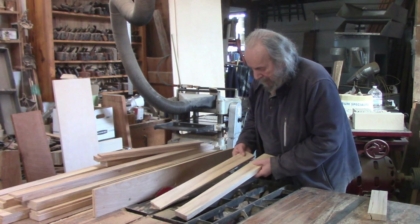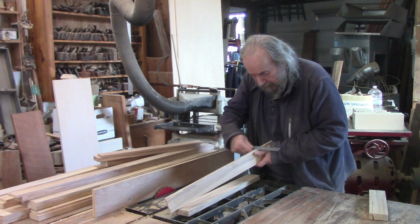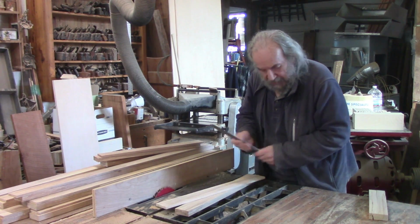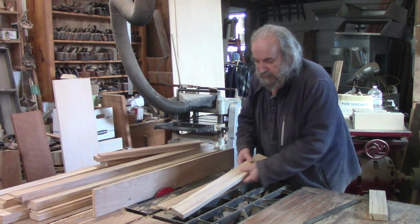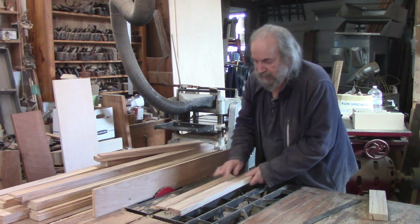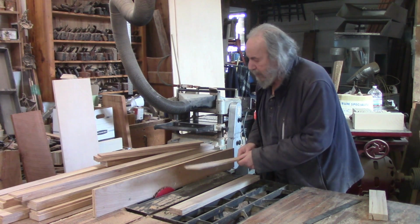Hey, so I just ran those all through the saw, and I've got these things that are ripped out to about 5/16, which means I can plane them easily without any fooling around, down to 1/4, actually close to 3/8 in places, but we're not counting that. Anyway, that's all good. Now I need to run these through the planer one more time and plane this side flat. That way, when I split this into two pieces, the last two pieces, they'll both have a certified flat, smooth, planed side. Unlike the sawn side, which is imperfect.